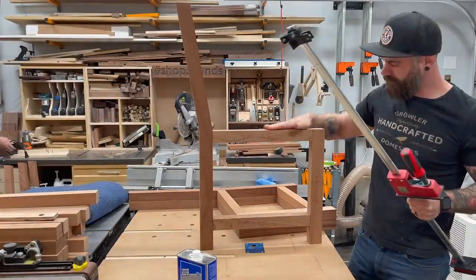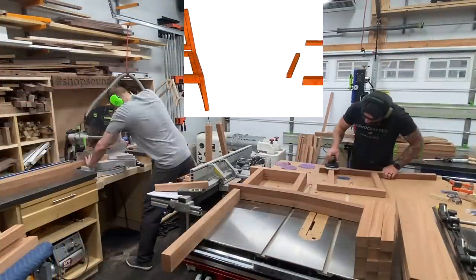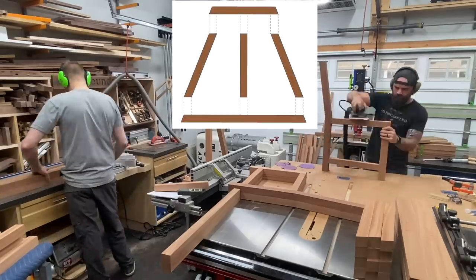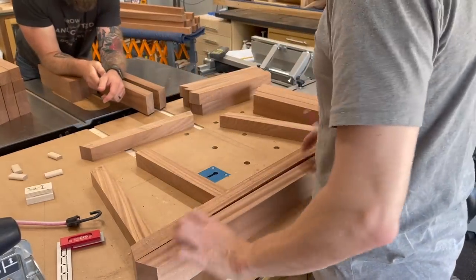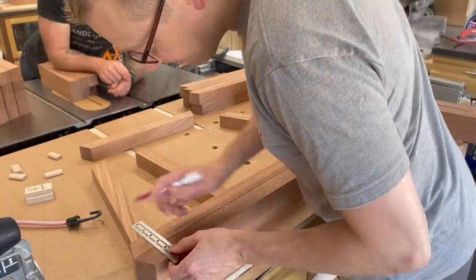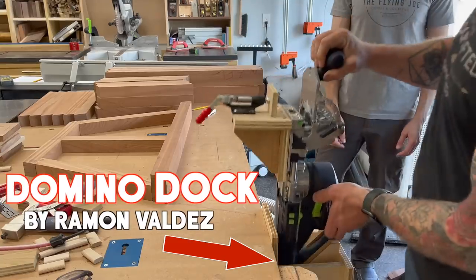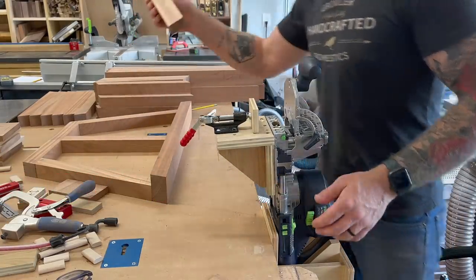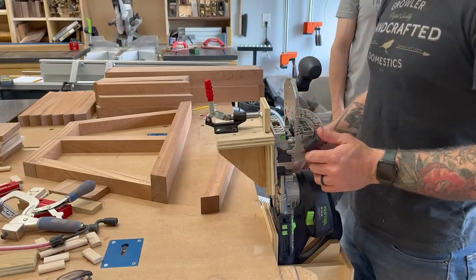Day three. The first thing to do was to get all the leg assemblies out of the clamps and sand them all smooth. While Jason sanded his life away, I started working on all the little parts for the seat assembly. All of them, except for that middle stretcher, have a 22-and-a-half-degree angle cut on the ends. The front stretcher is a little bit wider than the sides — it is three-and-a-half inches tall. To cut all the domino slots for these leg frame assemblies, we are employing the use of a domino dock provided by our friend Ramon Valdez, who makes these docks for the 700 as well as the 500 — see link below. We also devised a little clamping assembly that screws onto the base plate of the domino and allows each piece to be held firmly.